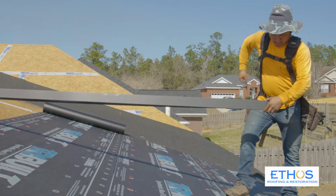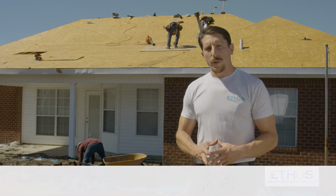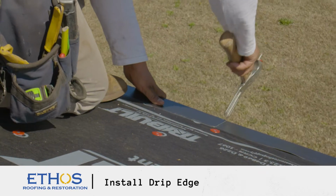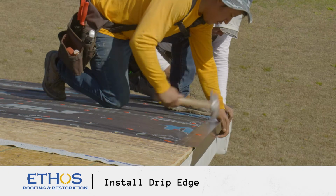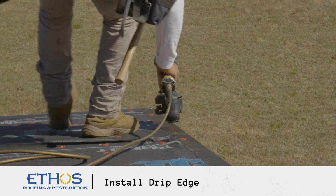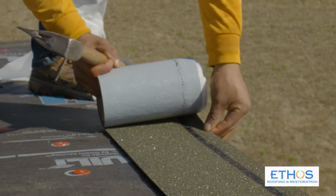The next step is to install drip edge. Drip edge goes around the perimeter of the roof and it prevents water from getting in on the edges. When we install this, we have to use a 4-inch staggered nailing to make sure the drip edge is not going to be moved by any wind.